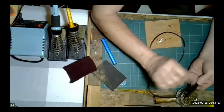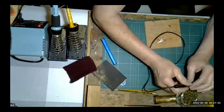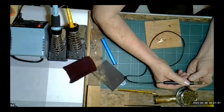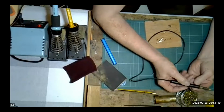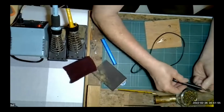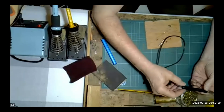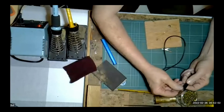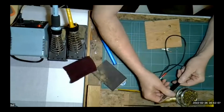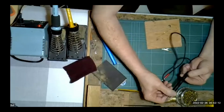So all I can suggest is that he may have been using it for long periods of time, perhaps on laminations or something like that, because that's the only time I've actually ever had a problem with these. If I've been doing some laminating work with it, and it's been in constant use, the heat starts to build up, and this can become soft. I keep meaning to make another one of these out of a different material, because I don't think it's actually plastic in the usual sense of the word. It's a Delrin or something like that, possibly. I don't know how well that melts, but I think it's what these are actually made out of.